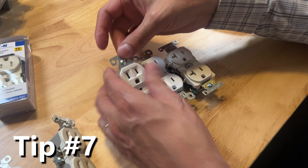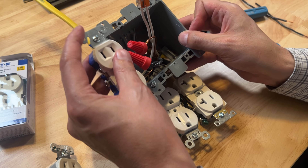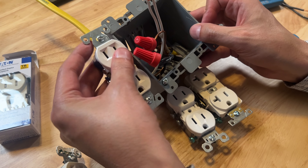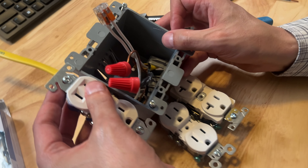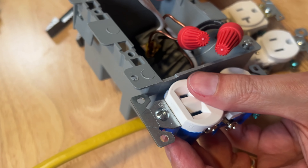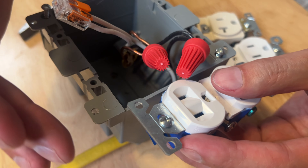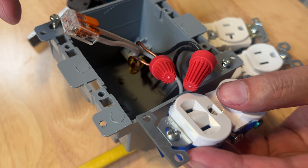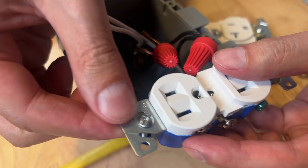Another hidden feature are these mounting tabs. When you screw into a box, sometimes the outlet will not sit flush. These tabs are designed to fit flush with the finished wall. The outlet might be indented too far or stick out too far depending on your application. A lot of times somebody will install a backer board or tile backsplash in the kitchen — the wall gets much thicker and then the outlets will need to be adjusted.